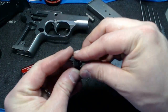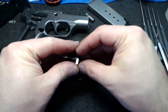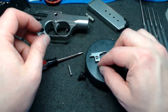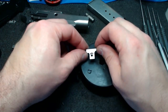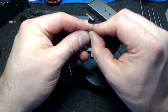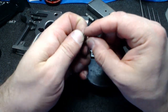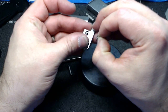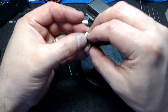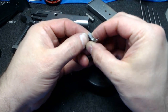Now, once again, I'm going to go ahead and take this apart and set it all up from scratch one more time, just in case you're skipping around in the video and have all these parts in a pile. We start with the ejector and the little spring itself. Now, in the ejector at the bottom is a little hole. This spring is a coil with a small turn, 90 degrees out on each side. So if you grab it by one of those and look at the hole, you should be able to guesstimate your way to lining it up pretty well, and it'll sit in there and ever so slightly protrude out the back, just a little bit. You can see it against my thumbnail.